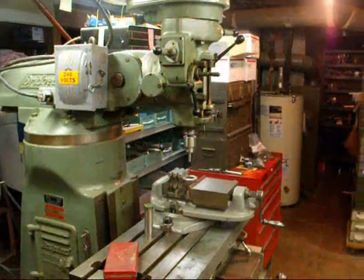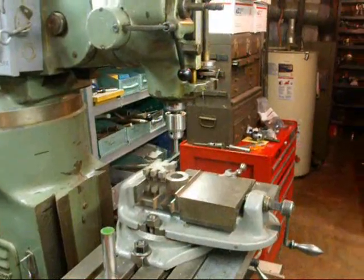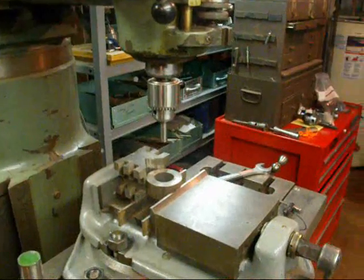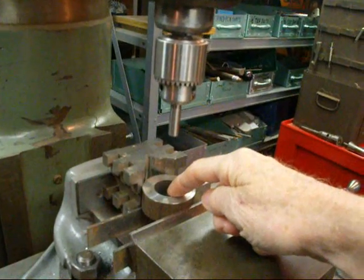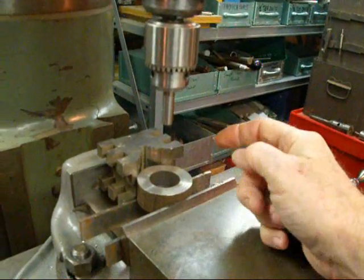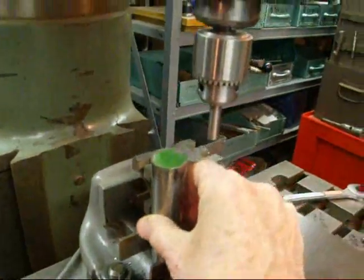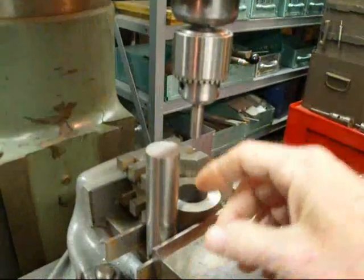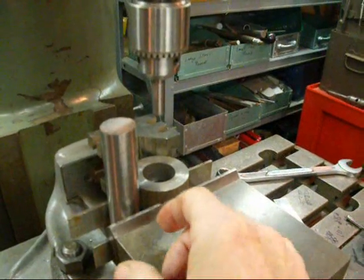Hello again, it's Tubal Cain. I'm going to give you a little more old technology today. The thing I'd like to show you today — and I'm going to have actually three videos on variations of this subject — but we're at the Bridgeport Mill now and I want to show you how to indicate your spindle so that it's in the perfect center of a hole, because eventually we're going to bore this hole. There might be other reasons why you want to find the exact center of something, or you may have a shaft or a pin sticking up and you want to find the center of that, and we would sweep the indicator around this instead of inside the hole, but the operation is essentially the same.